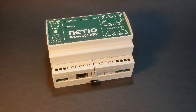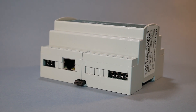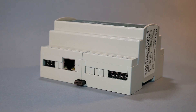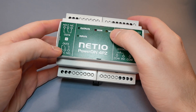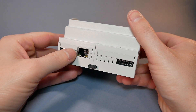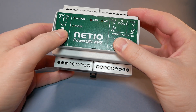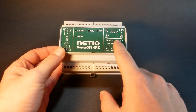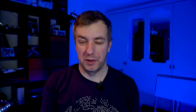The label itself reveals a lot of details, so let's take a closer look. First, you'll notice RJ45 - this is a 100 megabit connection, plenty enough to send data in and out. But if that fails, there is also Wi-Fi which you can switch to automatically in case there is a data loss, which is nice. This is 2.4 GHz. Looking at the label, you'll also notice that this device is split into inputs and outputs, because both are present on the device, which is exciting.